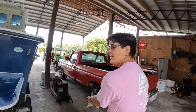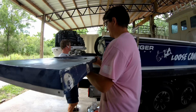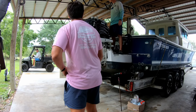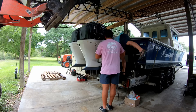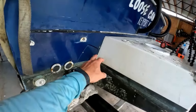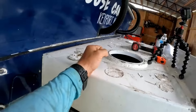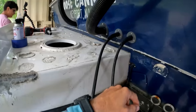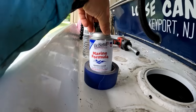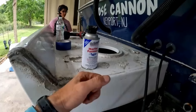We are ready to pull this thing up. We've actually got it pretty much lifting up where we'll be able to lift up on this side and I'll lift up on the other side. All the bolts are out of here. Obviously we've got the 5200 or 4200 holding this whole thing on here — it ain't coming off. So we're going to cut the line and see if we can get it to pop. If we can't, we do have some D-bond. We'll tape all along the top because you don't want to get this stuff on pretty much anything — it's some harsh stuff. You can't get it on the paint, gel coat, any of that. We're going to tape around the bracket and spray this if we can't get it to pop without it.